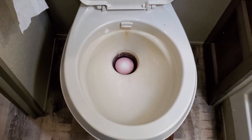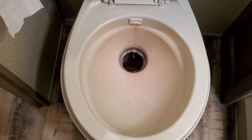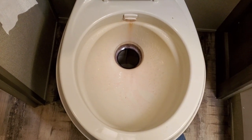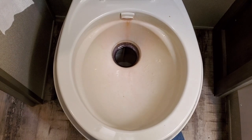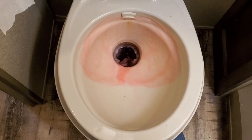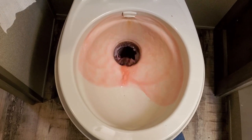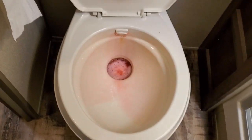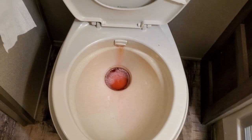And the toilet. It's kind of spurting and spitting a little bit — when you get a solid stream of pink, that's when you know you're good and winterized. And that antifreeze going down your drain protects your drains from freezing too. Okay, we're good to go there. This is winterized.